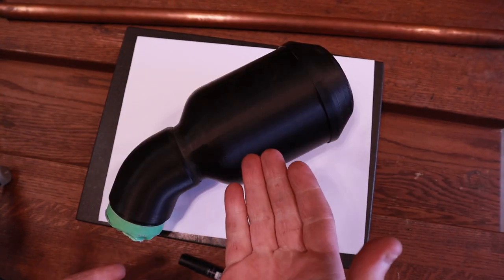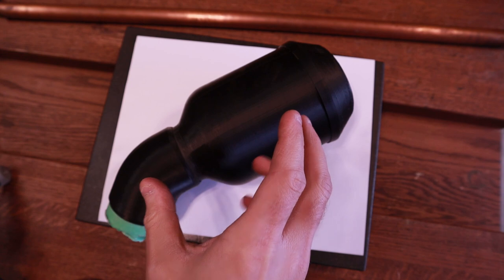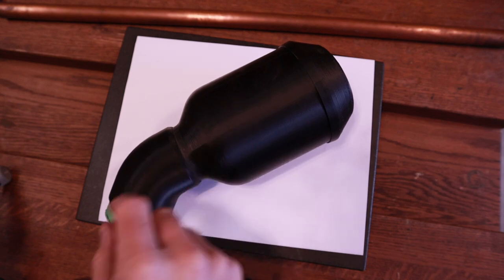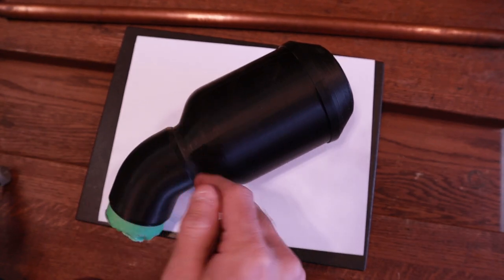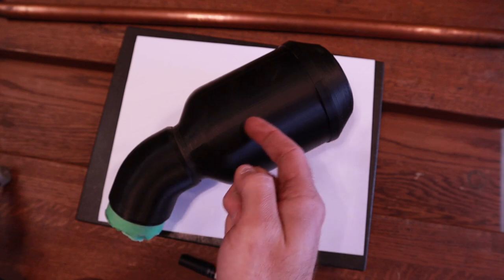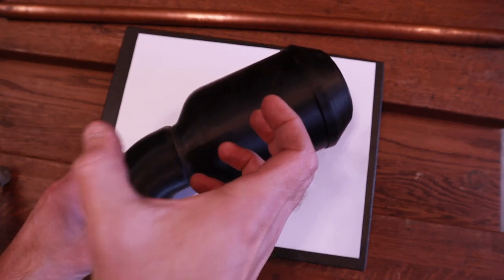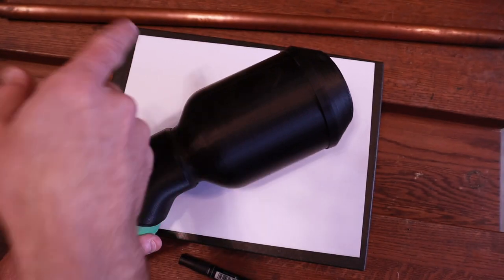So you might ask, okay, why wouldn't you just 3D print the entire part? What's wrong with that? Well, if you're a woodworker and you know about grain structure of wood, you'll know that it's weak in some directions and not in others. And the same kind of goes for a 3D print, at least this type of 3D printing, which is layered. So what it has is these kind of grain lines, each layer, and the layer bonding is not as strong as the continuous laying of filament that's putting down. So each layer and how it bonds together can actually crack if there's enough pressure on that. So what I want to do is try and avoid that by giving the majority of it, the beefy part of it, a 3D print, and giving the small portion of it that's going to get into those nooks and crannies, use the copper pipe for that.